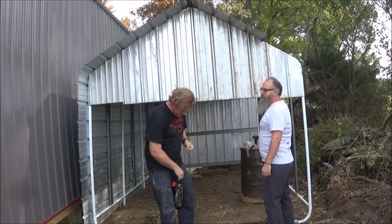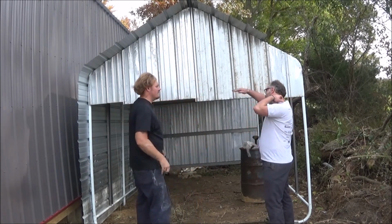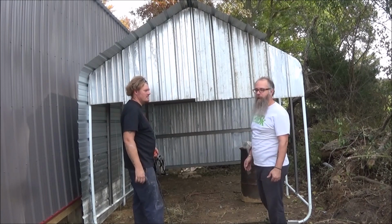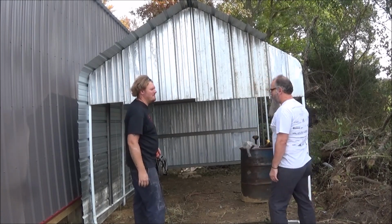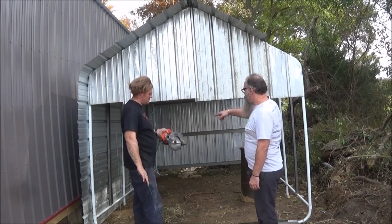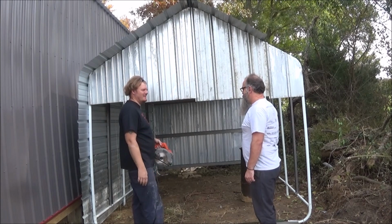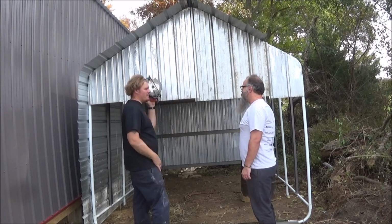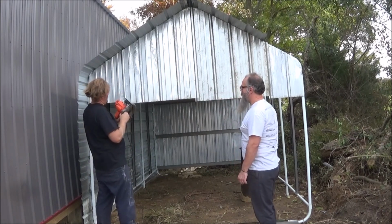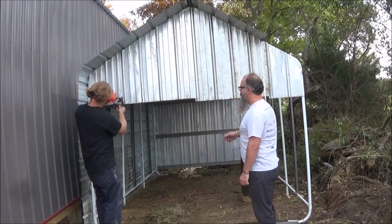We're gonna cut right along this dotted line we've marked here from this galvanized metal. We're basically gonna cause this to be even, so aesthetically it looks pleasing to our eyes. How are we gonna do it? We're gonna do this with a circular saw, a Black & Decker, with the blade turned backwards. It's 12.2 amps, and it's got a laser pointer. Blade turned backwards. Here we go.